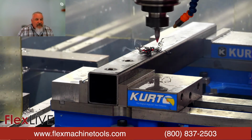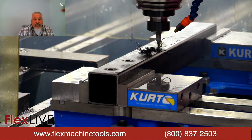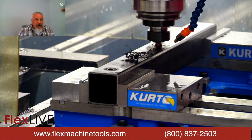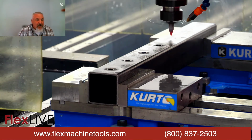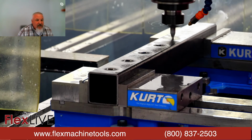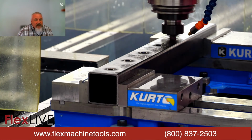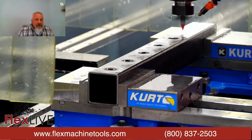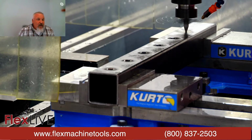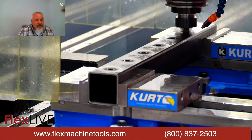and then a tapping operation. Now you can choose to use the roll form tap and then come back and thread that hole that Aaron's going to show you here momentarily, or you can choose to use a self-tapping screw. I'll refer back to the ATV industry and our customers in that industry. They choose to use self-tapping screws. So that's another option, I'll throw out there. I mean, you don't have to tap the hole. You can use the self-tapping screw if that better fits your application.